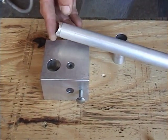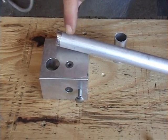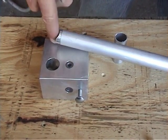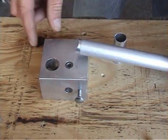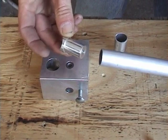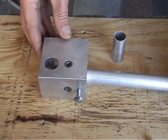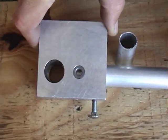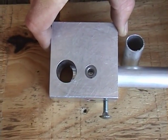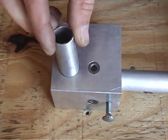This is a cross tube for the main section of the frame. We want to put our bolt 90 degrees to the vertical tube here. So we're going to put our stubby — what we're calling these — we're going to put that in here, slide it in the drill guide, and we're going to drop a tube in.